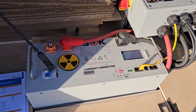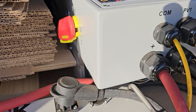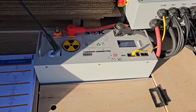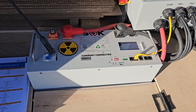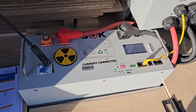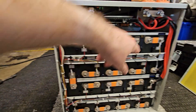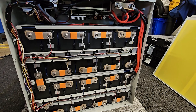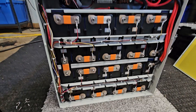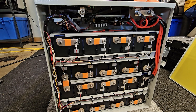I've got that connected to an SOK rack mount battery and I've made a few modifications to it. There's a terminal I pulled out — it was a little too close to the case and I didn't need two positives and two negatives. The other modification is I'm mounting it on its back, vertical instead of horizontal the way it's supposed to be mounted. I picked this one because it's got a lot of reinforced structure to hold the individual prismatic cells in place, which in a high vibration vehicle environment I thought was a good idea. I loosened all the screws on both sides, pulled it back, and jostled it back and forth to make sure everything settles to the bottom so the weight isn't supported on the screws — it's stacked against the bottom, which should let it sit vertically without vibration issues going east coast to west coast.